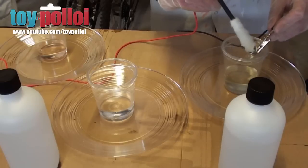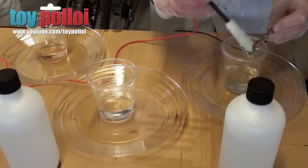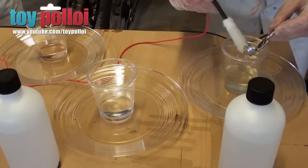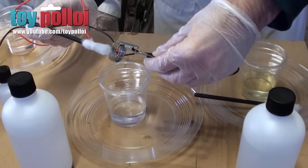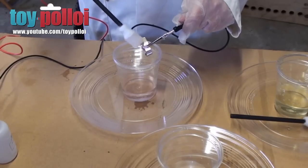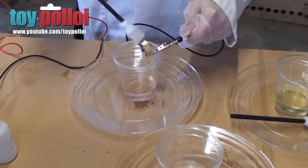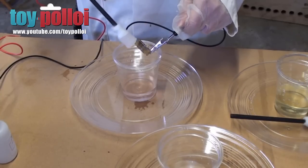The next part of this tutorial required me to find something that had already been chromed. This teaches you how to remove the chrome off an object. So if you've got something with damaged chrome, you can remove it just using a little wand with a specific solution, rubbing that over it. Then you learn how to activate the metal underneath and reapply a top coating — in this instance, a gold coating, so you can easily see that it's different. Again, it all seems a bit confusing at the start, but by the time I'd worked through this process it seemed a pretty easy thing to do. It's just a case of remembering lots of different bits of information, but luckily it's all written down, and the end result looked pretty good.